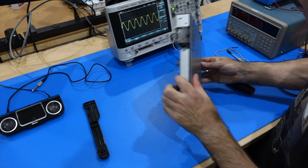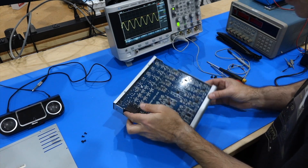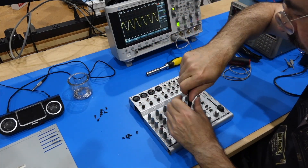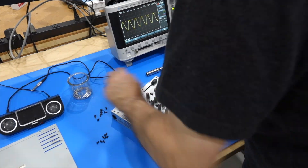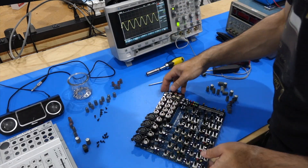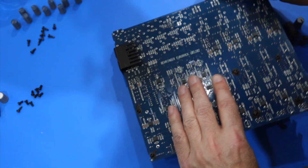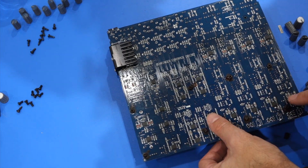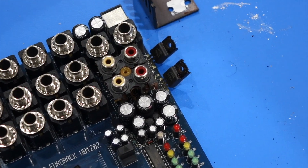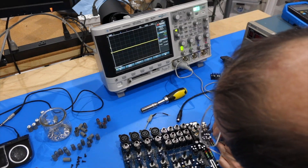There we go. It's going to be pretty annoying if we have to remove all the knobs. It's a pretty neat board, actually made for very quick assembly, with all the stuff going together. The amps are right here — this uses the same amps everywhere. And the power supply is over here! So after removing the heat sink, we can see that those are two 7815 regulators — 15 volt regulators.